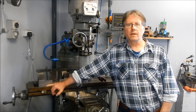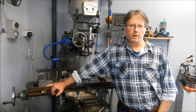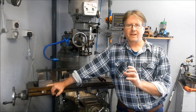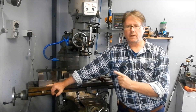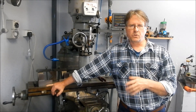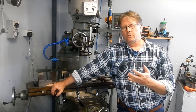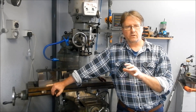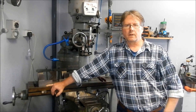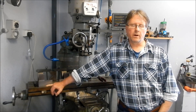I have seen that method used on bearings where bearings are down inside a deep bore and you're unable to get access to the inner ring to put a stick weld in it to shrink it. An old fitter I saw had made up a drift, used some grease, popped it down inside, and used the hydraulic press to push down and pop the race up out of the seat so they could take it out.